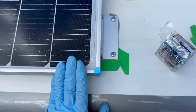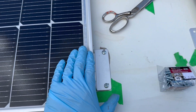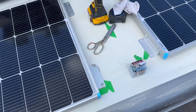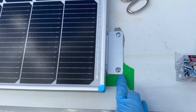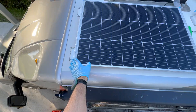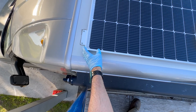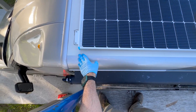I sure love those square head screws. I finish them using a manual screwdriver. I torqued those screws — it's a number 10, three-quarters of an inch. I kept about the same screws that LTV used on my original solar panel, and when I torqued it a little bit, the butyl tape oozes around the Z-bracket — so I think it's going to be just fine. Once the panel is installed, I will cover the Z-brackets with Dicor self-leveling caulking agent and call it a day.